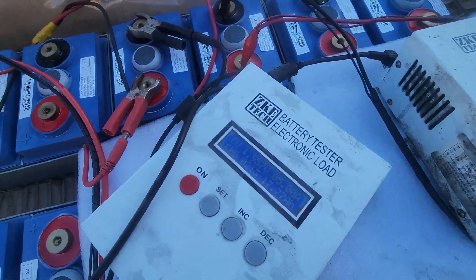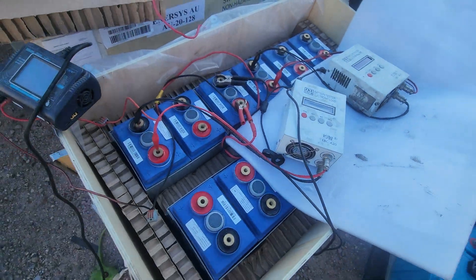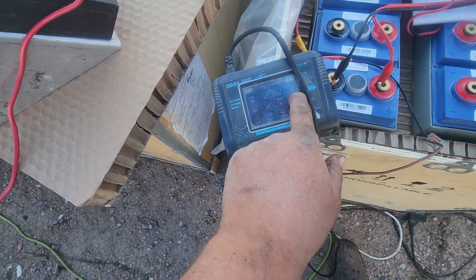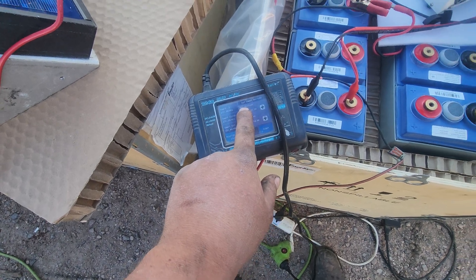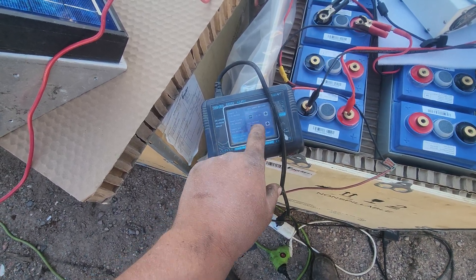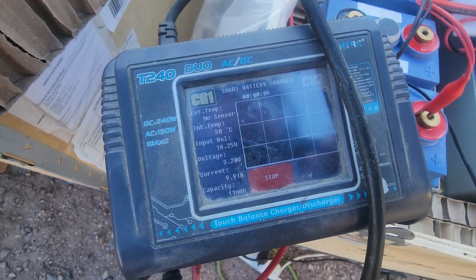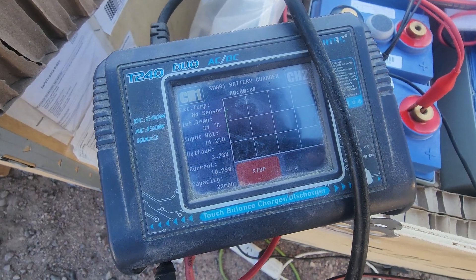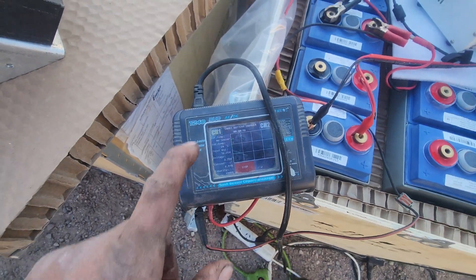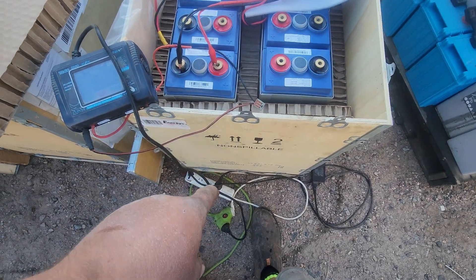I'll give an update in the next day or so depending on how long this takes. Five amps an hour is mighty slow, so we'll just give these a boot for a few. I might go to smart digital power, set it to like 4 volts and start pushing it in there, because even at 10 amps this little charger is not going to be able to do any damage to that cell. Six volts - who cares. Look at that, 10 amps - just to get some juice in that battery. This one's running on AC and those ones have got DC in from little transformers.